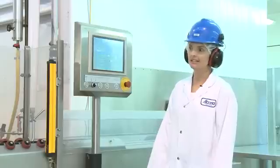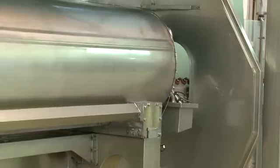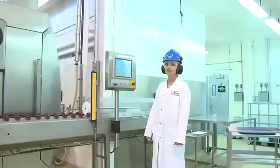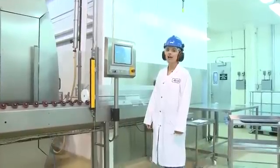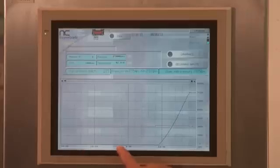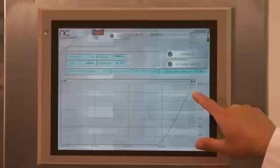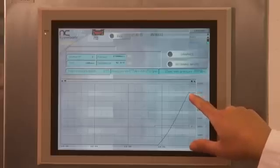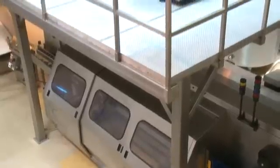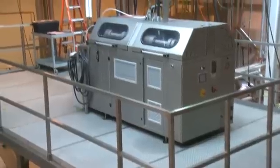The product gets loaded into the machine. The pressure vessel is moving into place. Once it's in place, the plugs will be placed in and the vessel will start filling with water. On the operator panel, you can track the increase of pressure — see it goes up here? It's maintained at 87,000 PSI. Up on the mezzanine, we have intensifier pumps, and that is what is maintaining the pressure in the vessel.